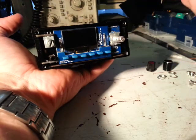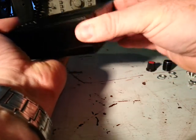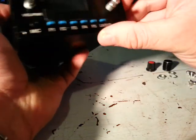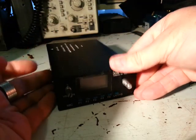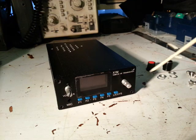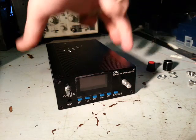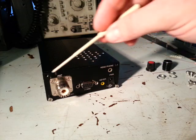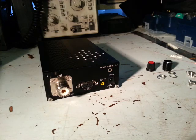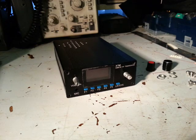From there, put on the front panel. Before doing up any of the hex bolts or screws, do a quick loose check with your hands — give it a squeeze and a nudge, make sure all the pins are lining up okay. Then it's just a matter of putting the four hex screws back on the front, your washers and nuts and knobs on the front, ensuring the rear connectors are all lined up, the two hex nuts back in here, and tightening the lower two — and that's it. Power it up and make sure you haven't blown it up. Seventy-threes from VK3TW and VK6TW, seventy-threes.